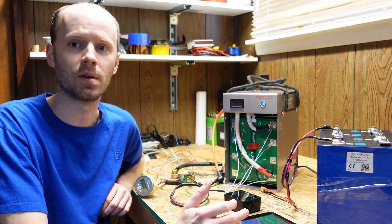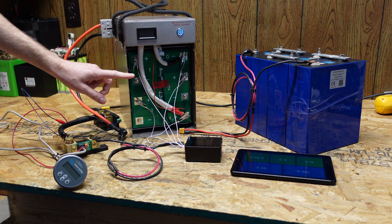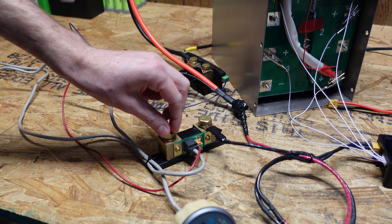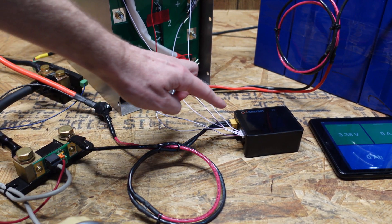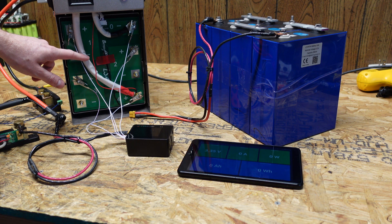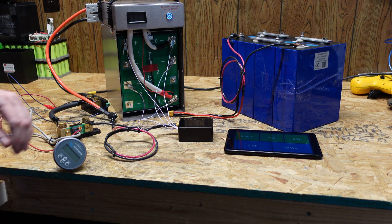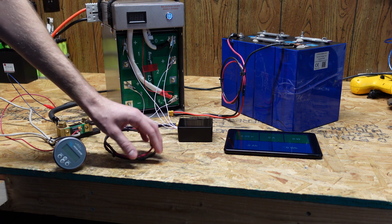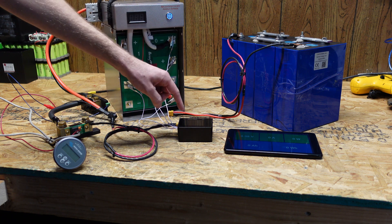I'm not sure if this video will be interesting or not, but I'm going to upload it anyway. So we've got quite a lot of wires going on in this setup. The battery for this test is going to be my big battery — a 170 amp hour power block. The negative is going through the Batrium shunt block, then through the Victron shunt block, and then over to my iCharger X6. The positive goes directly into the iCharger X6. I also have the balance leads from the iCharger connected directly to the big battery power block. On the side, I have my battery bank of EVE 280 amp hour lithium iron phosphate batteries. The idea is to take all the power from this battery, run it through both shunts and the iCharger, and then regeneratively charge it into the LiFePO4 battery bank — giving us three separate readings of amp hours consumed.